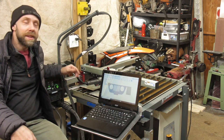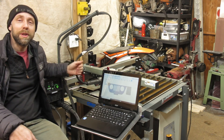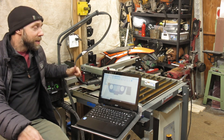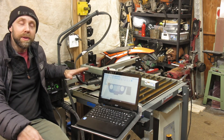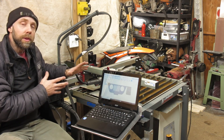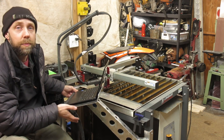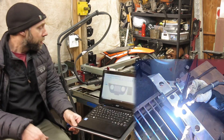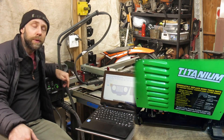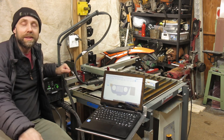Hey guys, it's Michael here. As you probably know from one of my last videos, I just picked up a Langmuir Systems Crossfire plasma table. Been super happy with the CNC machine — it's been really cool to be able to program your own parts, cut them, and duplicate parts. This video we're going to go into a little more detail. Last video we just cut out an aluminum laptop stand as a little project, but this video we're going to go into more detail on how to hook up the Titanium Plasma 45 to it — actually how to hook up almost any plasma torch to it, as long as it's not a high frequency start.